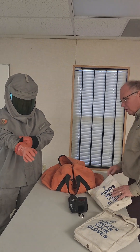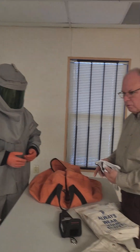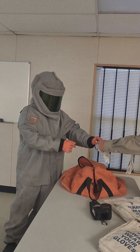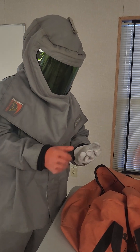So can you wear any shoes with that? Not tennis shoes — that's why it's important for you guys to wear E-rated shoes. Then you've got to put these on — you can have a double glove system: this is for the inside and this for the outside. This outer glove is a protector for the rubber to make sure it's not damaged.